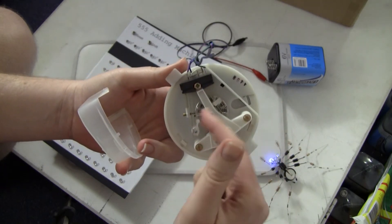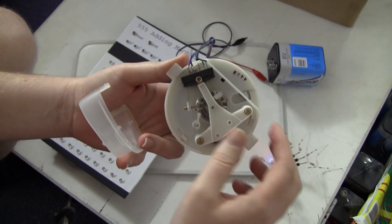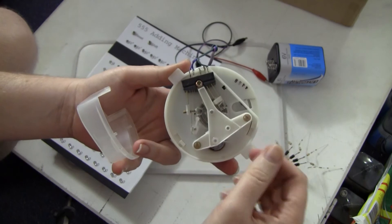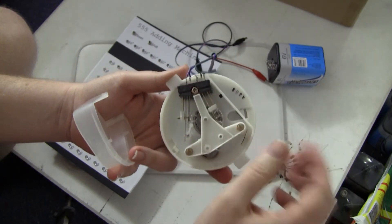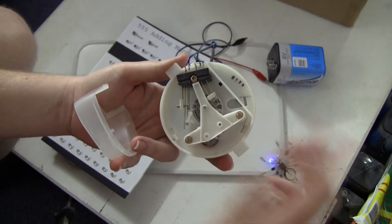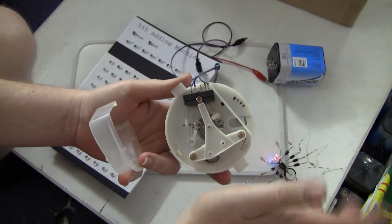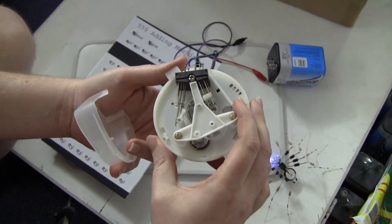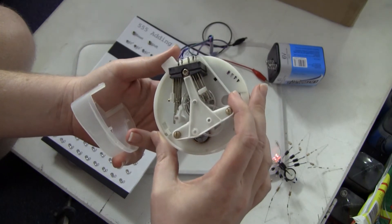I checked on the scope — the impulses are almost exactly 100 milliseconds apart. And obviously this used to drive, back in the days of points and button kind of exchanges, mechanical steppers that would step around a contactor, and the precision of this device was obviously quite important to the operation of the exchange.